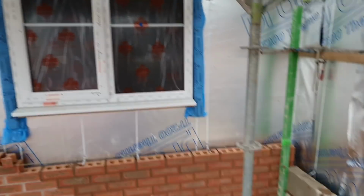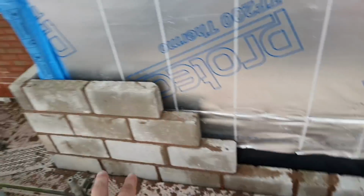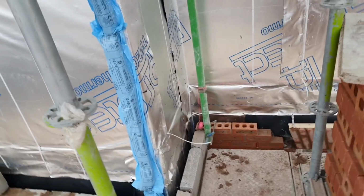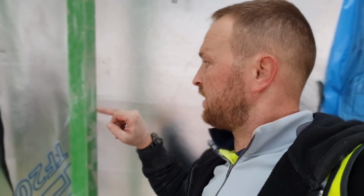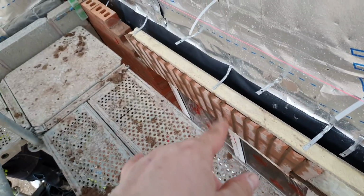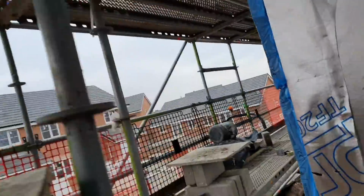Right, so this is all we managed to get done first afternoon. Got this brickwork set up, blockwork corner in, the lintel underneath, trays and damp sorted. Got to change the bond on this blockwork to make it work because there's a half in the middle, but we'll get rid of that. 3/4 on the ends. Got rid of that in one course. Blockwork's a little bit low as well, 15mm, so we're trying to pick that up to get back to gauge. You have to finish 15mm under these sills. So what you do is put your pencil mark, line over, gauge down 15, set this up with the same gauge, and then you know what you've got to get picked up to. That's in there ready, setting. Hopefully it'll go off overnight, and then we can get this pulled up in the morning and move across. Shouldn't take us too long now we've set up and got all this stuff across. But yeah, first day done. It's nearly 4:30, so let's get off and get out of here.